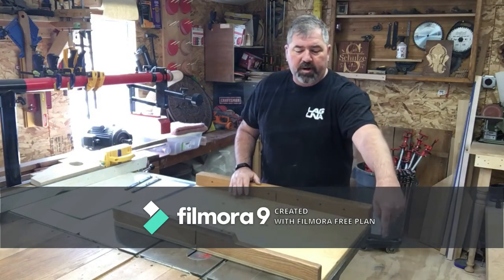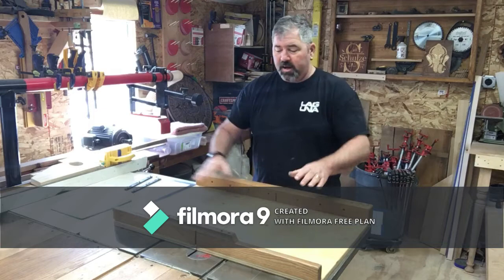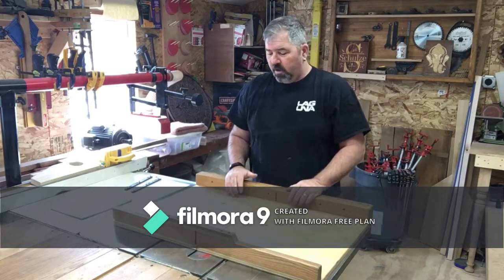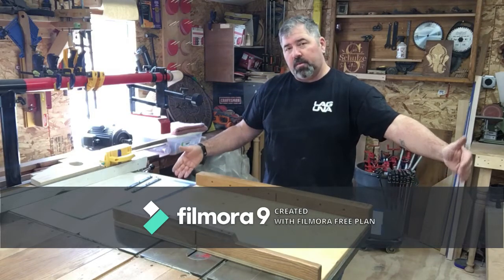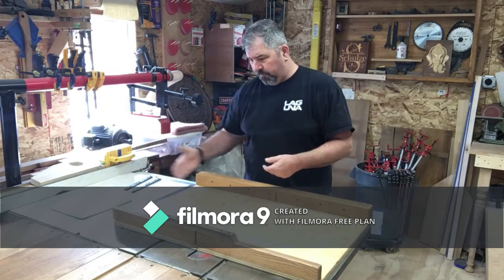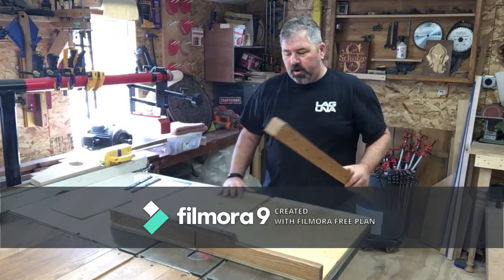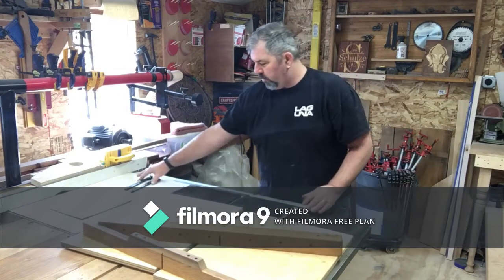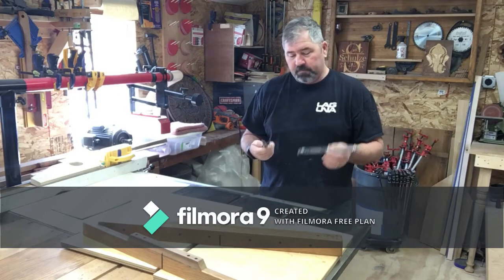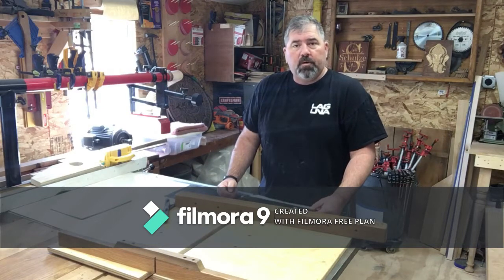That's when we decided it's time to build a sled that has a little cutout here. We're going to use 1/2 inch material. We're going to cut some holes in it with the CNC to keep it light. Put the holes around the exterior edges, and it'll be a little swoop. So the full sled is going to be 3 feet, but I'm only going to have 12 inches on this side because we can use the fence for measuring on that side for cutoffs. This has been all knocked apart. We're not going to reuse any of these pieces except for the micro jig sliders. So let's go look at the CNC machine and we'll give you a quick tour of that, and then we'll talk about the actual design of this thing.